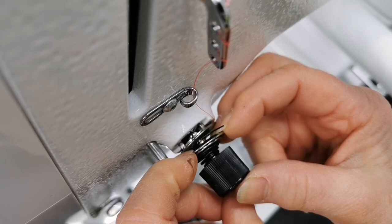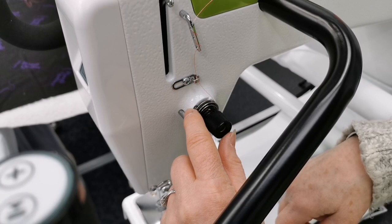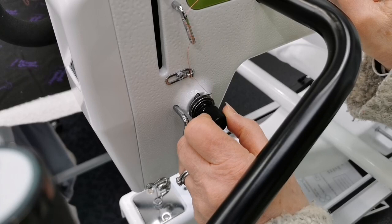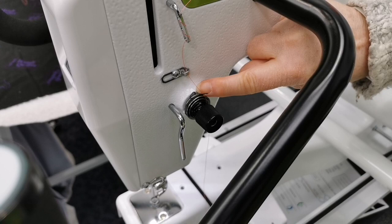This is the spring. The normal operation of the spring is to move like this back and forwards. It should not be either too loose or too tight. When we do our tests to make sure it's okay, when we are sending out machines, we always do a check to make sure all our machines are hunky-dory after they've flown over here. And one of the checks we do is to make sure that this assembly is firm and that the spring, this upright part of the spring, should be facing about 12 o'clock or slightly towards the 11 o'clock. That upright, can you see that bit in there?